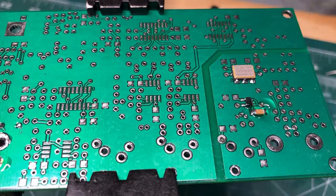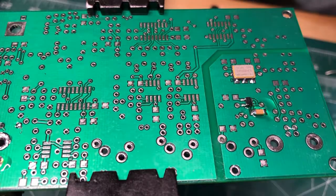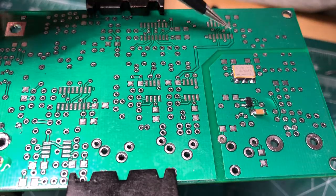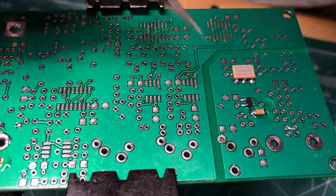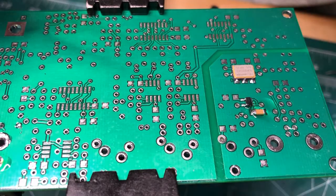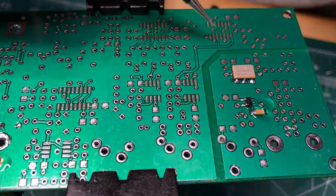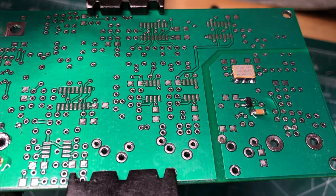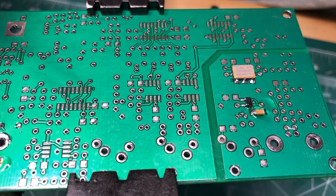And that's getting an SMD component down. Obviously, with those size of SMD components, it's pretty easy. You have to do other techniques with these smaller pad sizes here, but it's kind of the same thing. Use lots of flux, get it down, tack one side of it down, and then apply the other side. A little bit of a different technique on these ones, and I'll do a demo of that in a later video. So anyway, thought people might be interested in that. I'll continue with the rest in high speed mode.